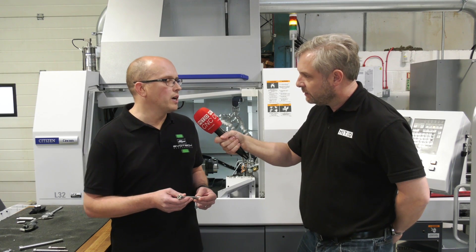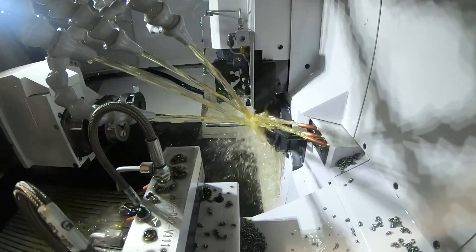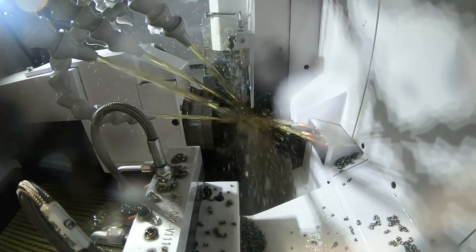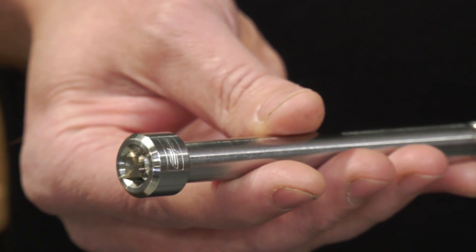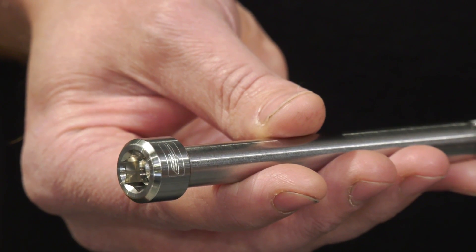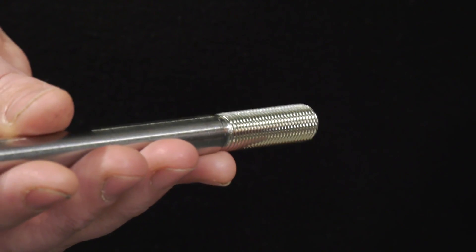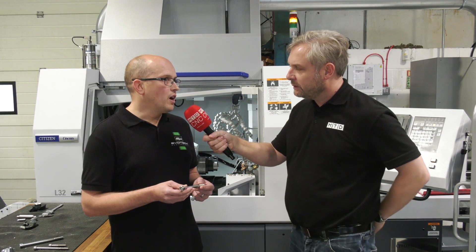We were close to buying an L20 but needed the torque to roll-thread the threads, because an L20 simply wouldn't have the torque — it would have meant screw cutting instead. With screw cutting as opposed to thread rolling, you don't get that integrity and strength, because when you roll-thread you're forging the thread on rather than cutting it, so there's no material removal. These are long parts — we turn them at 19.05mm and cut straight to finish: no roughing, no finishing, all done in one pass.